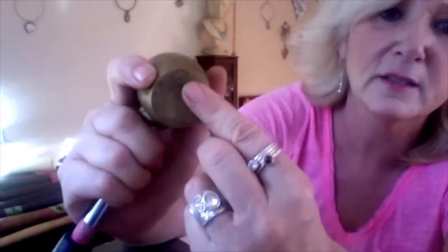They make them in different styles, the one that looks like a claw hammer, but it's small and it's also heavy, and it's really good for that too. What you want on the brass hammer is a nice big face. And it's so soft because it's brass, it just grabs onto your stamp. You can see how marred up these are. But they're not ever, again, going to hit your metal. They're going to hit your tool. They're like a giant chasing hammer.